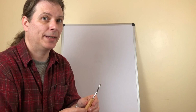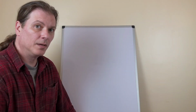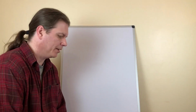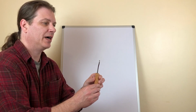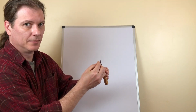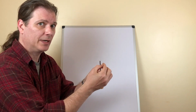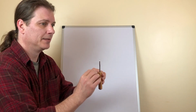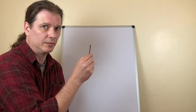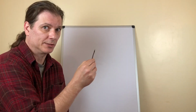And this is where graduated bevels come into play. Okay, I thought of something that I should divulge here. I've been talking about this as a 45, when in fact it is 90 degrees. Now, from the split in this bevel, the two sides, from there it is 45 and 45. But it is not overall a 45, because the use of this is not as a single bevel graduated bevel chisel. It is a dual bevel graduated bevel chisel.